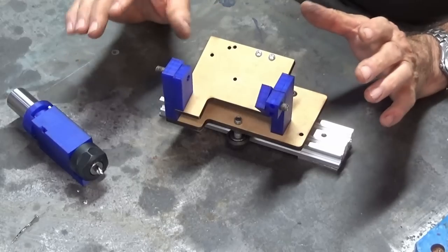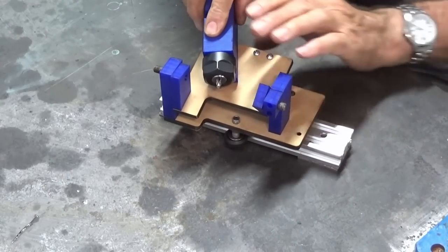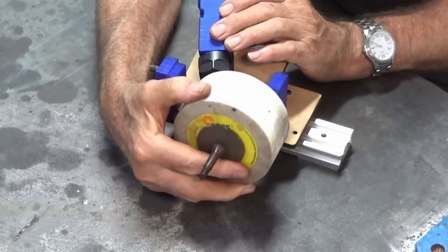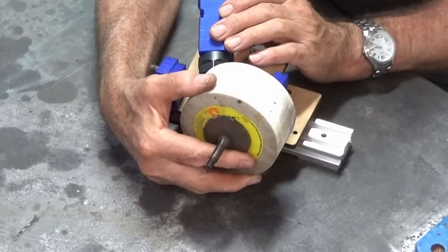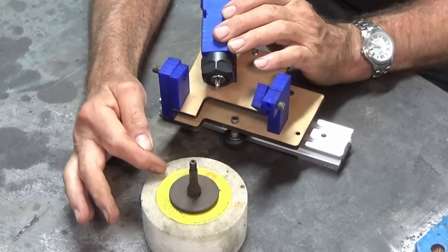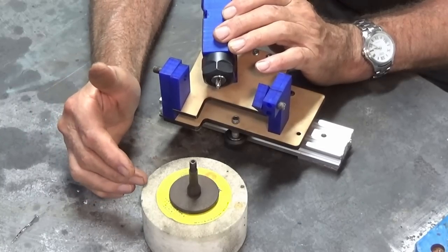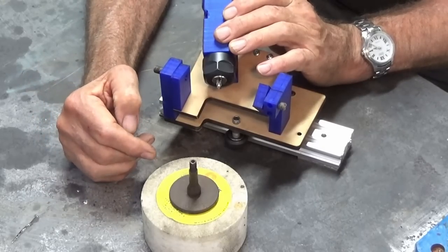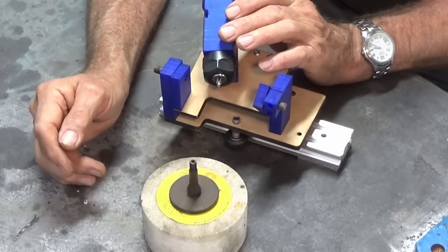So they're the parts. Now you need to be able to have a grinding wheel in front of that drill bit, of course. And the wheel that I'll be using is this one. So this is just a cup wheel and it's going to be mounted on a spindle, and I'm going to be driving that with a belt drive and an electric motor. Now the driving system for this wheel is actually an old Quorn tool and cutter grinder that I had made. Now I made it and hated it. I hardly ever used it. I ended up buying one of those Deckel clone tool and cutter grinders instead. But I've got the spindle and I've got the motor mount and I've got all of the rest of it, so that's what I'll be using.